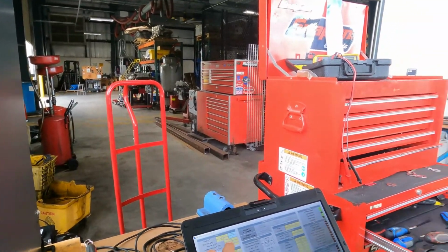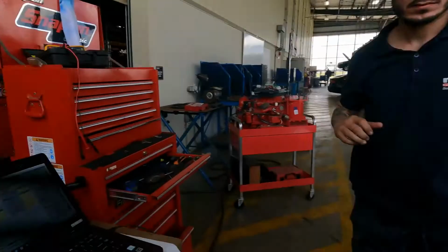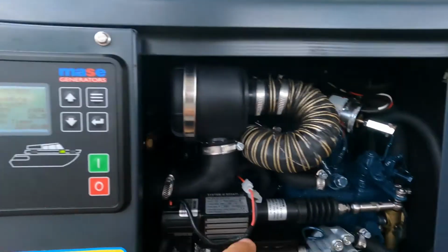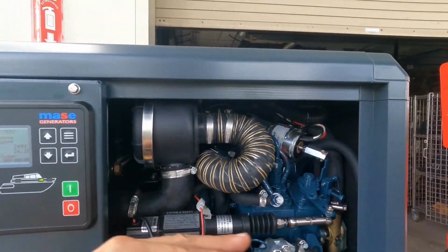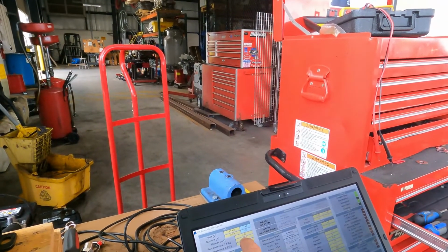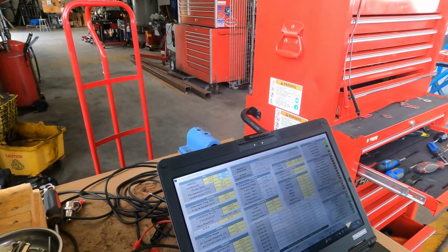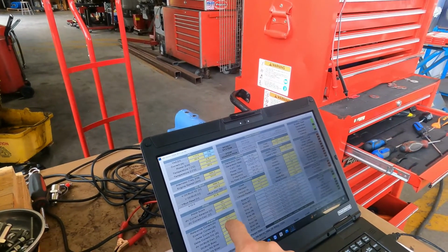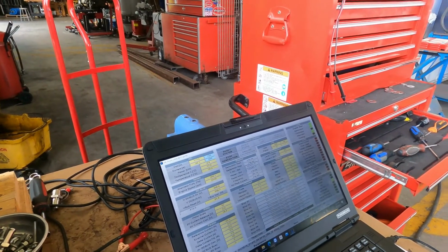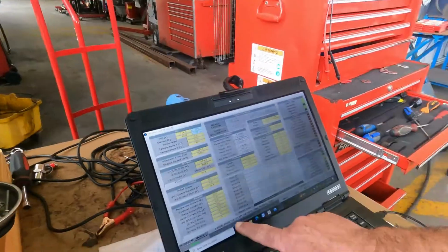We are going to check with load. We are going to apply 2000. Okay, the RPM 24, and the adjustable calibrates the RPM. We have 2.6 kilowatts of load. The output voltage 114. The current 23 amps, the consumption in amps. Oh, that's excellent. That is the information for the software. That's the software, yeah.